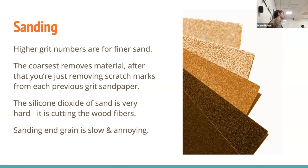A lot of hardwood, if you use a chisel or something like that, there's a really nice finish. So when you're sanding wood, remember the bundle of straws analogy. If all the straws are aligned, when you cut something, all those edges of the straws that are cut kind of stick up, and they're kind of scraggly. So that when you sand, that kind of evens them all out.